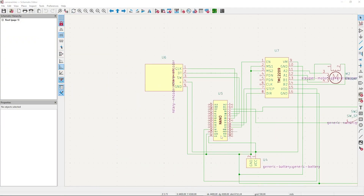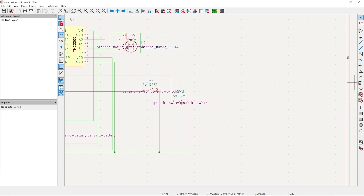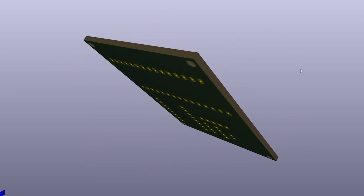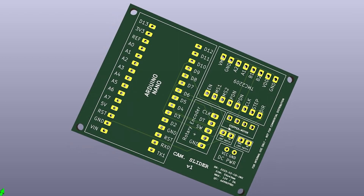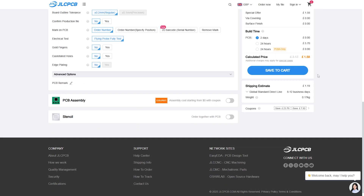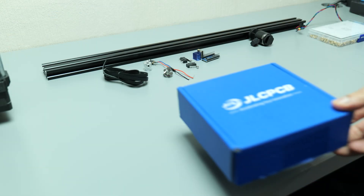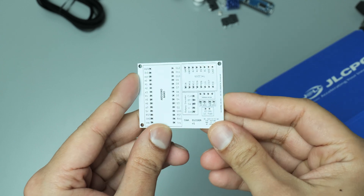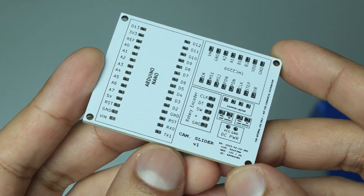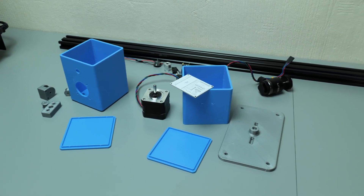While I was waiting for the 3D printers to finish making all the parts, I decided to make a PCB for this project. For this I used KiCad. I started off by making a schematic with all the main components and the connections laid out, and then the actual PCB itself. For the first time, I wanted to get a custom made PCB, so I used JLCPCB as an independent customer. And honestly, I was really impressed with the whole system. It was really straightforward. All I had to do was export the Gerber and drill files from KiCad, upload them onto JLCPCB, and the rest was taken care of. The PCB was delivered about 5 days later, and I was really impressed. The PCB looks clean, crisp, and it's nice and compact. And so with all of our parts together, it was time to get everything assembled.